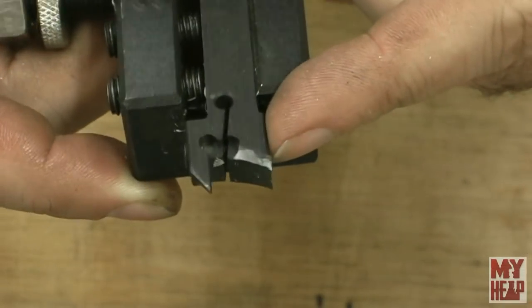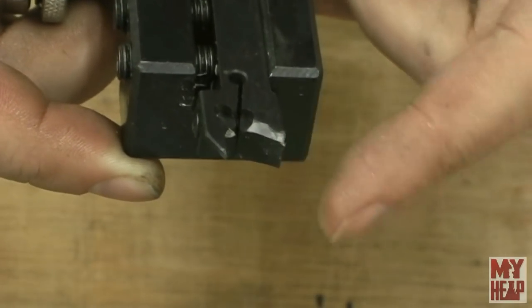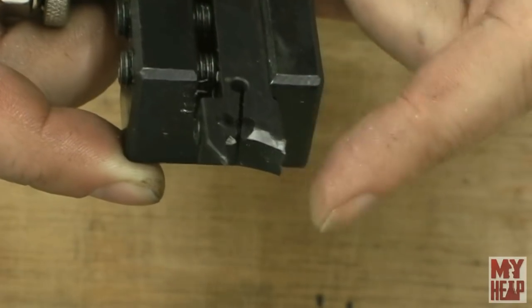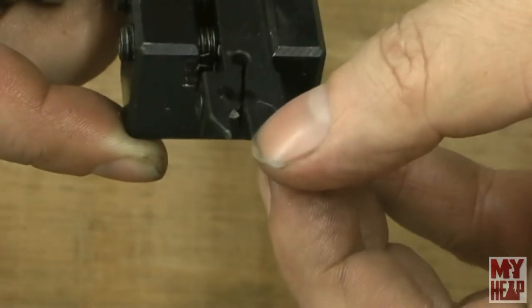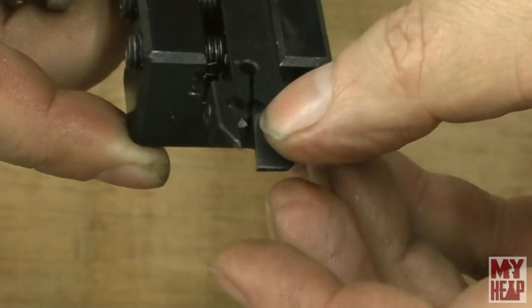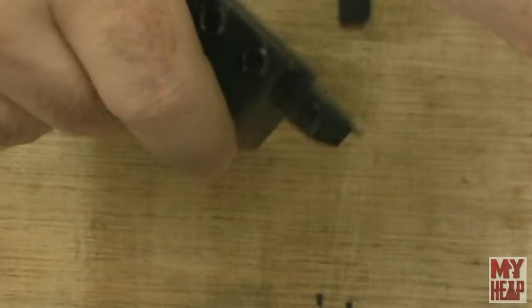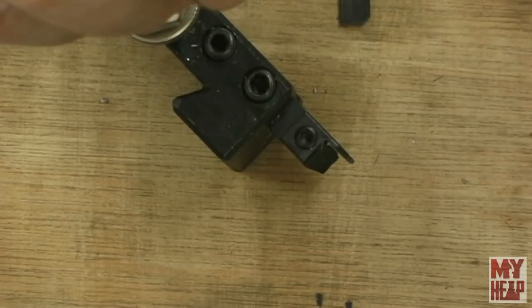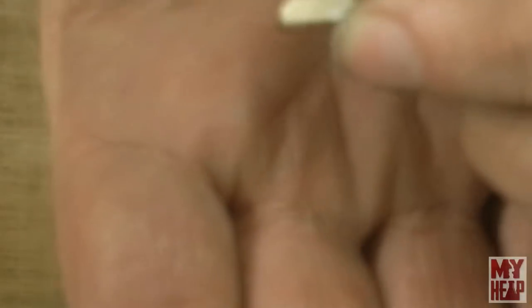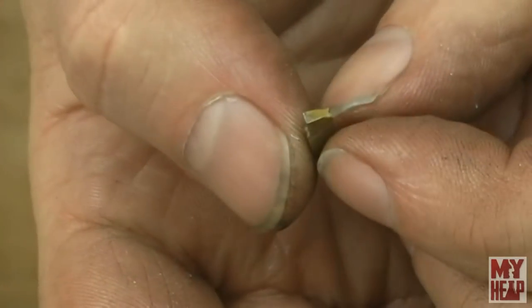So honestly, if I can keep it in frame, I think I got a defective tool, and I think it's defective because I think it was hardened, but I don't know that it was heat treated. You know, I would have never expected that to snap just making a cut on aluminum, and of course it did. It did snap the end of the carbide tip off.